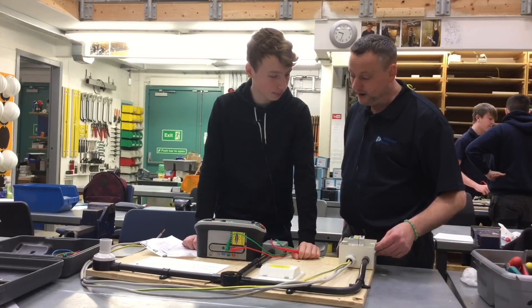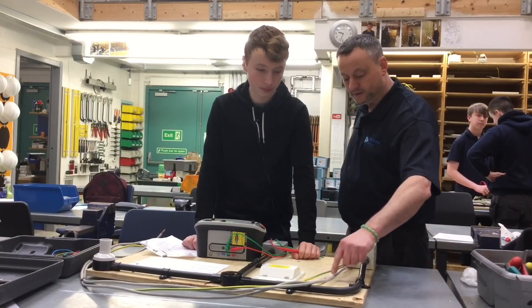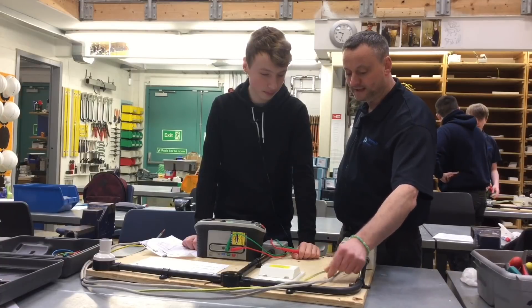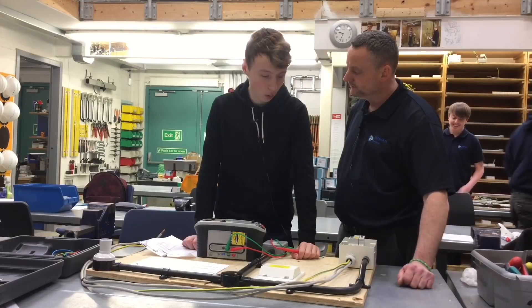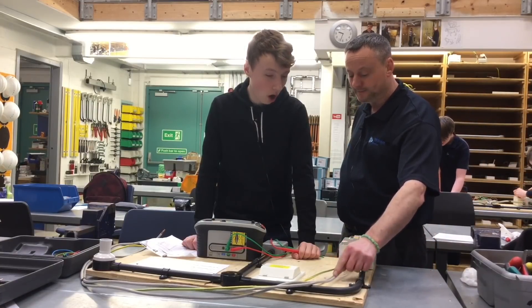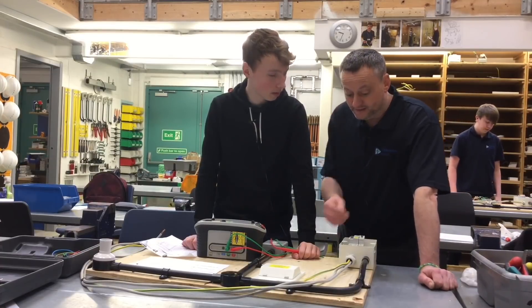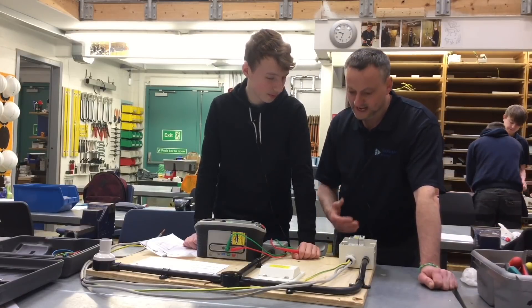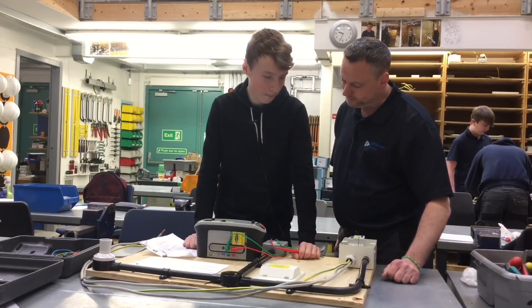So are you happy with the insulation resistance test? Yes. Now we can go on and go live. Which of these conductors — this is the most difficult question — should we have had connected during the test in order to insulation resistance test all of them? The line and neutral, or earth? The earth itself has to be connected to the supply authority's earth. And we're 20 weeks in and we're still at the stage of remembering that we must connect that main earth conductor in order to carry out the test. Really well done!